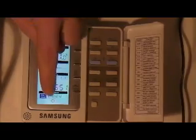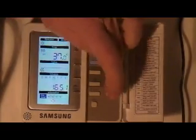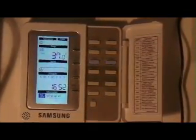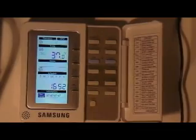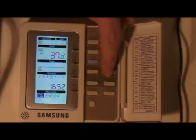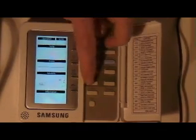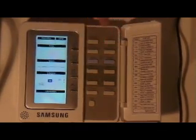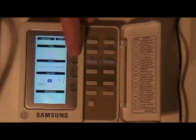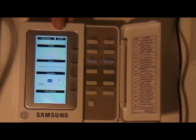So if you see this symbol here, you must press this to clear it. Sometimes people program the units to enter into silent mode. This is done with the timers — if we start the timer and set it up, it's possible, using the silver button, to scroll between silent mode at the bottom and hot water mode at the top.